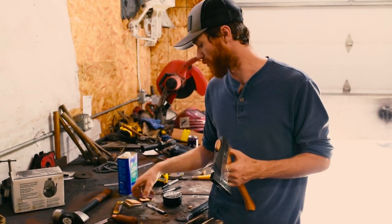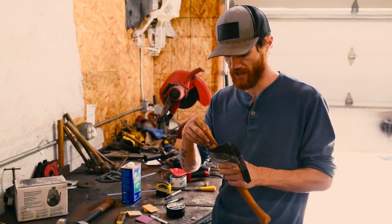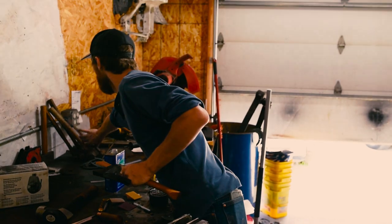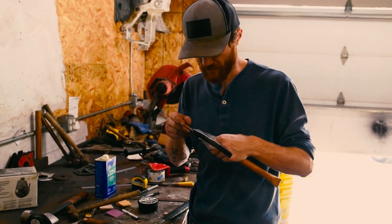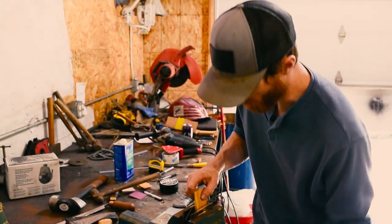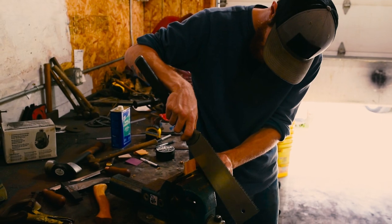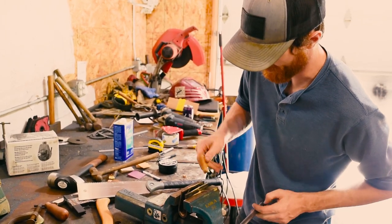So we get to select a wedge. We're gonna use a canary today. This looks really pretty once it's wedged. So we stick this wedge in here, and then we mark it for the width. This one doesn't need much taken off, but we do need to take a little bit off. So just pull saw that off here. Actually, let's draw knife it off. I don't think a pull saw is going to work for that.